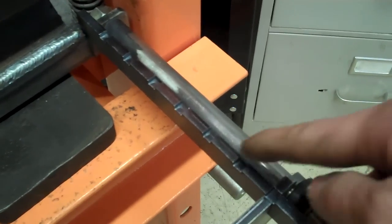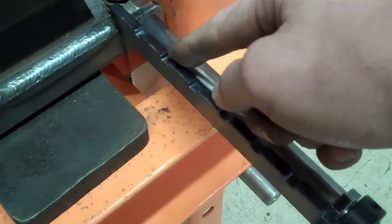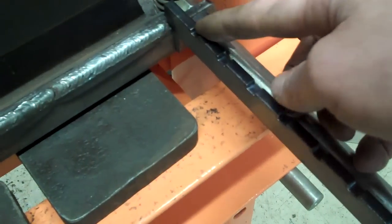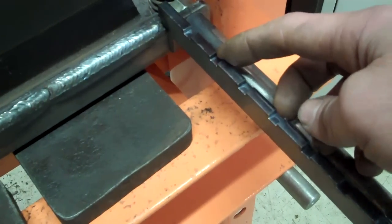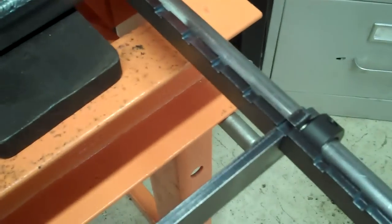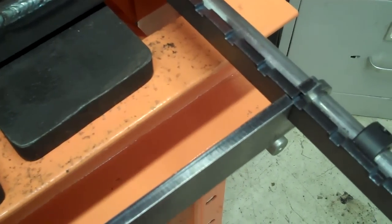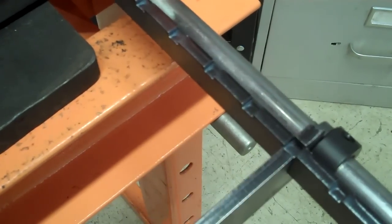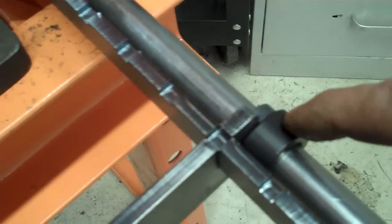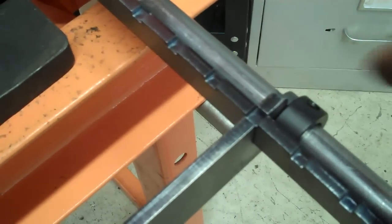Your sidestop has 17 laser-cut notches. Each notch represents the distance from the notch to the center line of the die — the first one is two inches away, the second one is three inches away, and so on. Your backstop slides in these rails; you line up the notches and tighten your two Allen head set screws. This allows you to do repeatable bending over and over again.